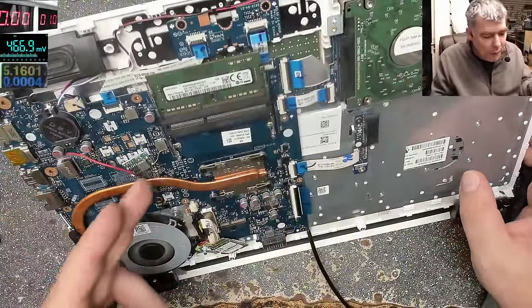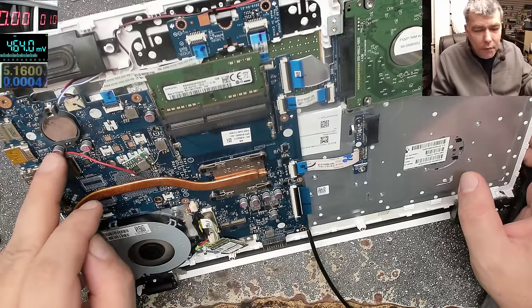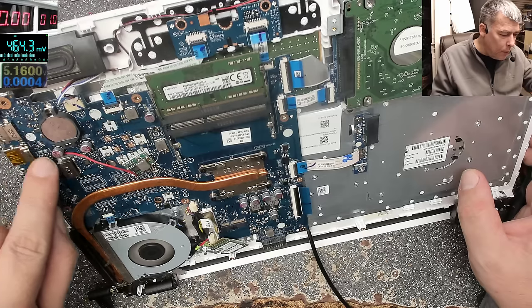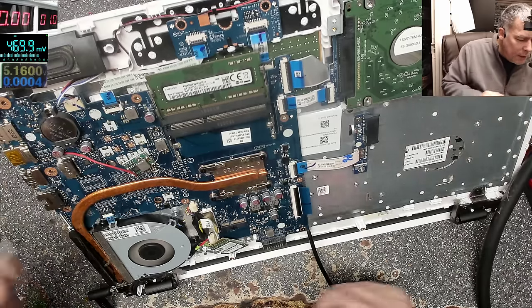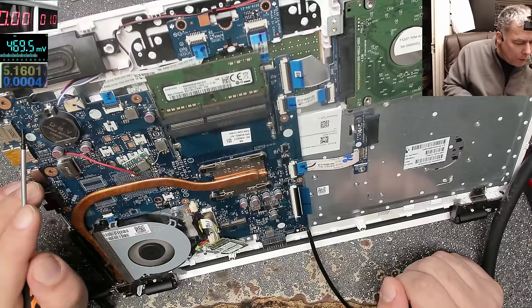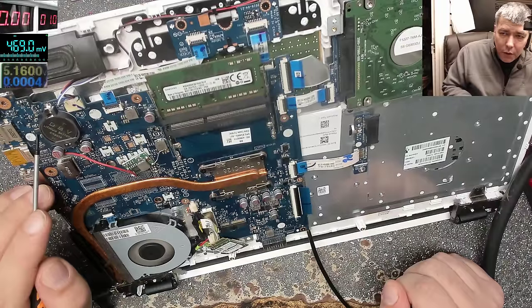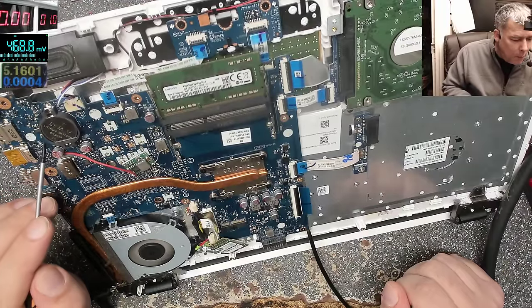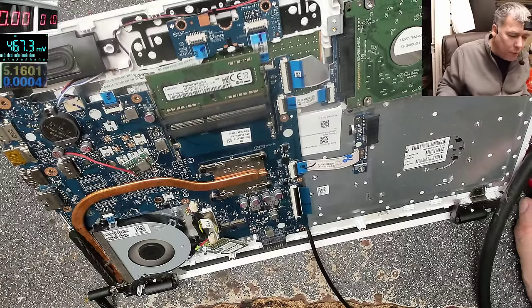That's what I did: the power supply connected on the output of the coil and to this power rail, which is the 5 volts one. It's a big power rail. How do I know it's the 5 volts one? Because I can see it's coming from the USB port. It's this chip which is cutting down the USB if you short the USB. And it's coming here to this capacitor. It's a big, big track. So that's how I knew it's my 5 volts one.